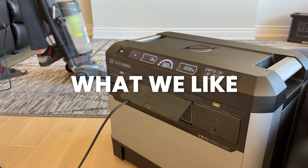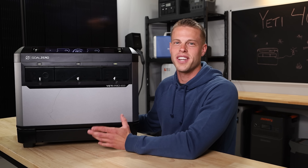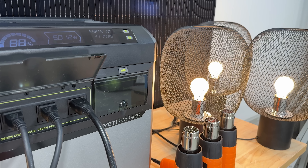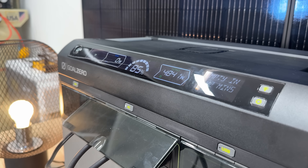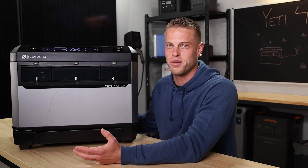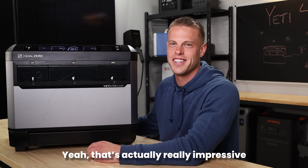The first thing that we really liked about this was its performance. I surged the heck out of this thing, tried to get it to trip, and it would do everything it could to just try and keep running. Super impressed with how it was doing. It surged 5,250 watts for 10 seconds and 4,800 watts for over a minute, and did it repeatedly. Even then, it wasn't tripping. I was just stopping the test to see if we could repeat this over and over. I think that's actually pretty impressive.